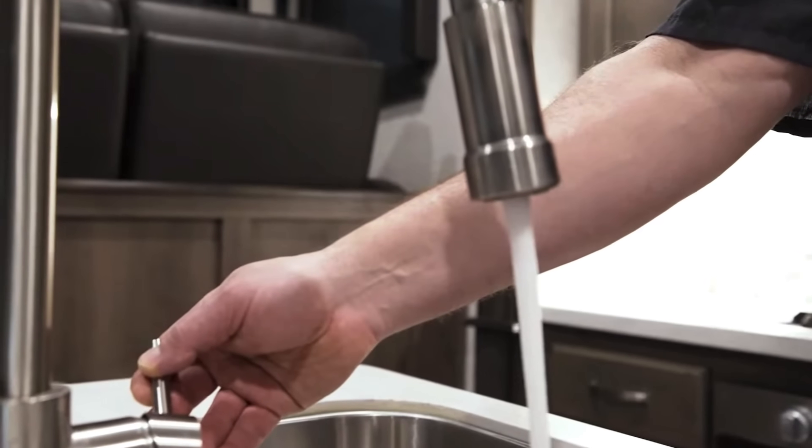Go in and turn on your water pump. Then go to every single water fixture — faucets, showers, toilets, outside showers, ice makers, even the tankless water heater. If you have a water heater, turn it off. If you have a tankless water heater, turn it off, and we'll try to simply push the food-grade antifreeze through it. Most of the time that works perfectly. You do not need the tankless water heater on; water pressure will still come out, just at lower pressure.